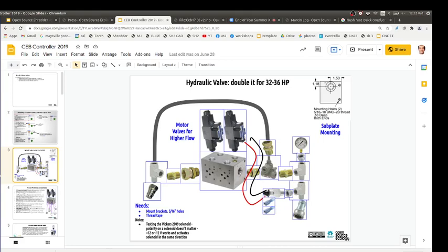The high pressure is going to be on the high pressure side, before any implement, like before the cylinder on one side. The fluid on the rod side, when you're spilling that fluid, is going to be low because it's connected to tank. Anything connected directly to tank before the active element is going to be at low pressure. So on the return side, you can actually use regular plumbing fittings.